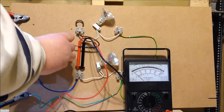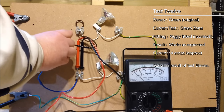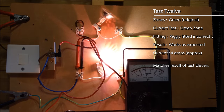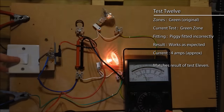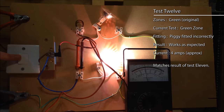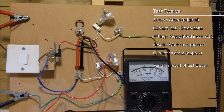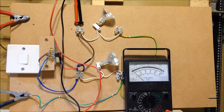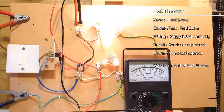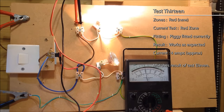So let's flip the piggy the wrong way around and see what happens — does that make a difference? No — we're still getting 4 amps. Just the one fuse — the original green fuse — and we're measuring 4 amps. Exactly the same as before. Let's turn our attention now to the red circuit. We'll put the piggy holder in the correct way and just fit the red fuse — only one light fires and we're getting 4 amps again.